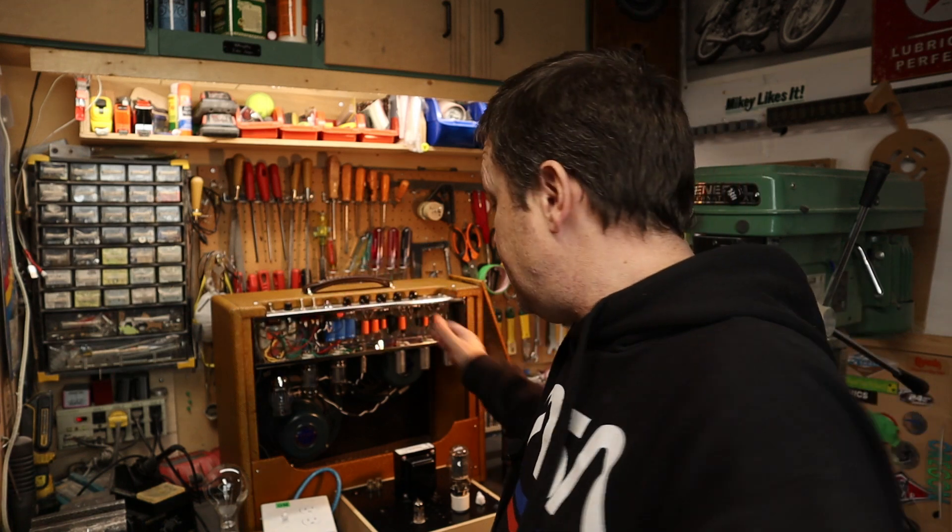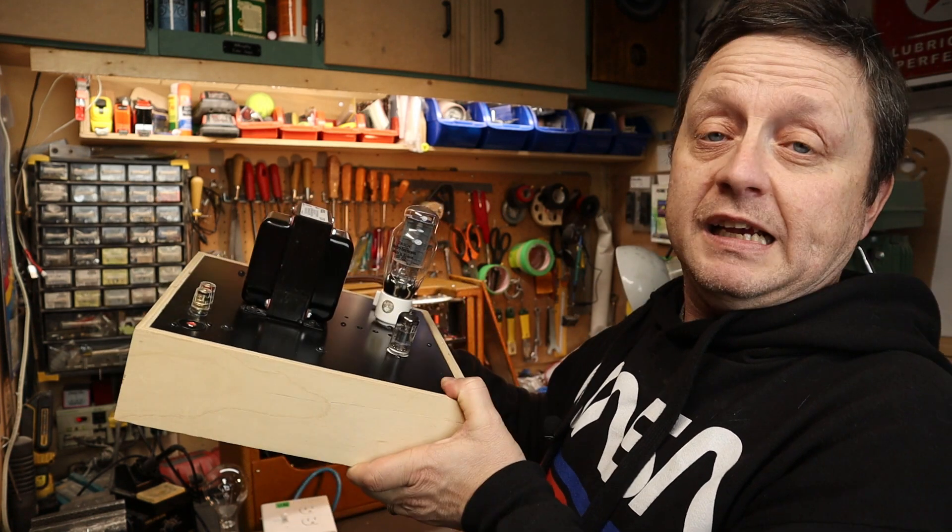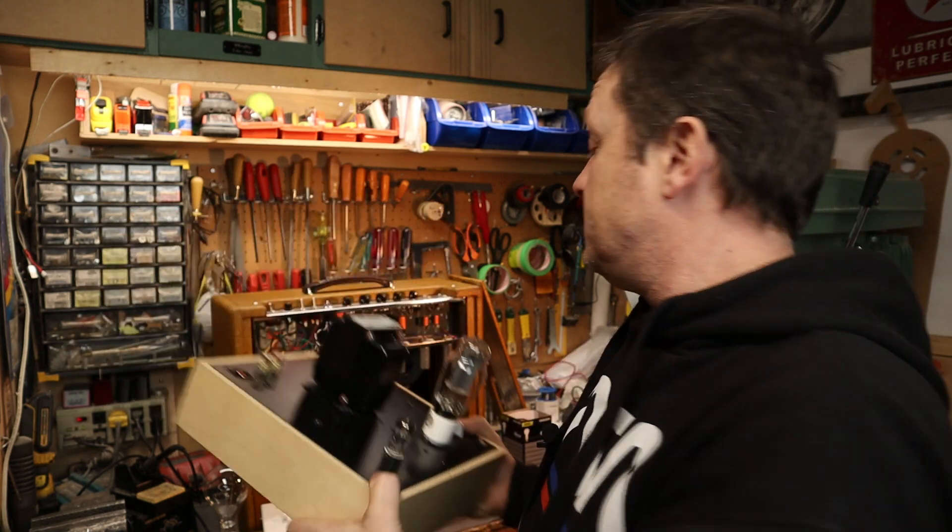Hi, it's Mike. Thanks for clicking into this video, welcome to my channel. I'm in my shop today to show you a little bit of a tech tip. As some of you might know, I like to build tube amplifiers — guitar amplifiers and hi-fi amplifiers. This would plug into a set of stereo speakers. Whenever I'm working on an amplifier doing initial startup, testing voltages, or anything like that, I always make sure I plug it into a current limiter.